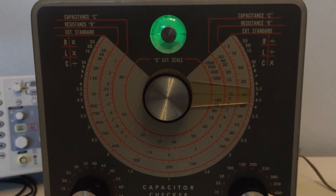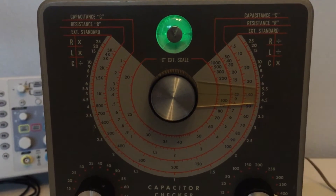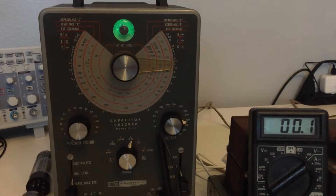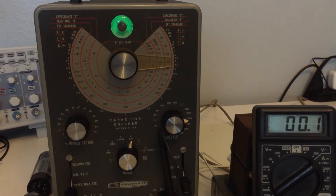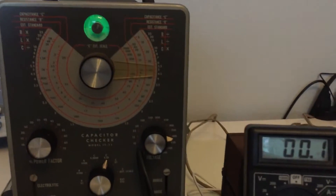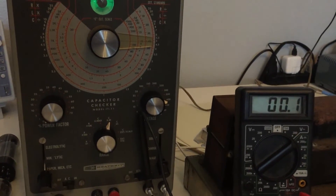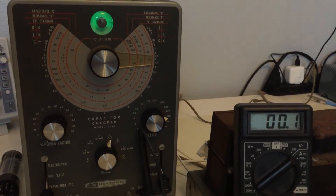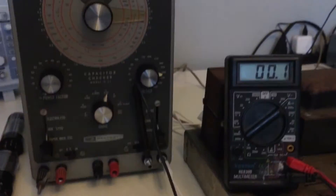If we wanted more specific information, I could hook an ammeter up to see exactly what's going on. The tester was just calibrated and tells me there is no leakage on this cap at 400 volts. For the purposes of this documentation, I included my micro ammeter as well. What I found was that at 400 volts it's showing one tenth of a micro amp of current going through, which would just as easily be zero — there just really is nothing. This capacitor is good to 400 volts DC and does not leak.